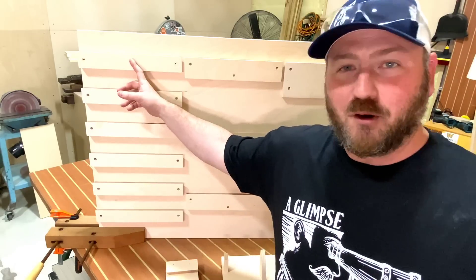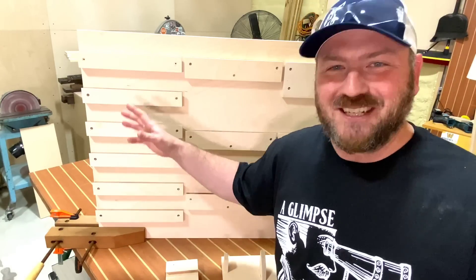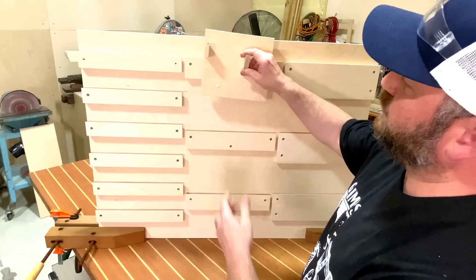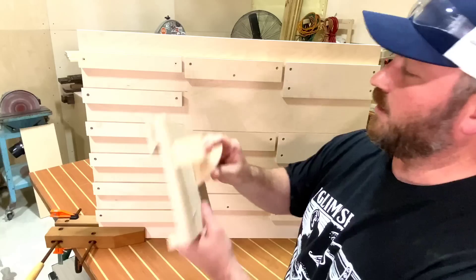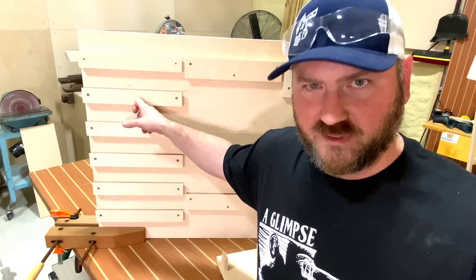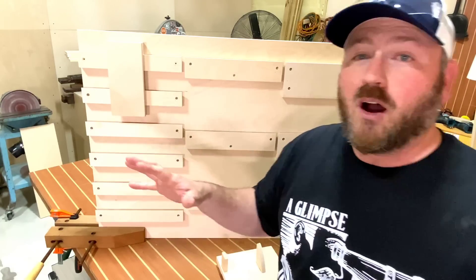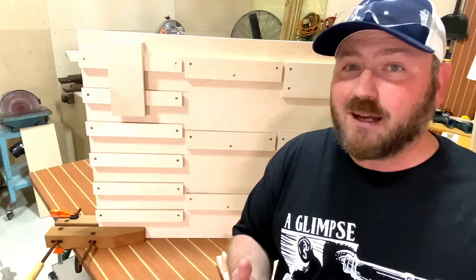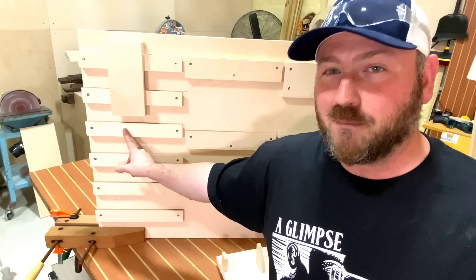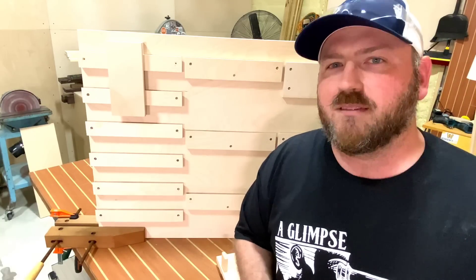The first type is this one on your left — a roughly two and a quarter inch cleat, spaced every five inches. The beauty of this system is you don't need a typical support block, because with so many cleats, the actual support for your hung piece is the next cleat down. There are some downsides though: it takes a lot of time to cut all these 45-degree pieces, and it costs a bit more money. It's really cool when done though. There's a video by Frank Howard where he did this in his closet — I'll link it below.